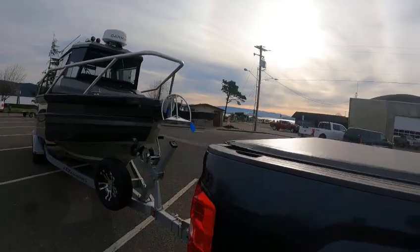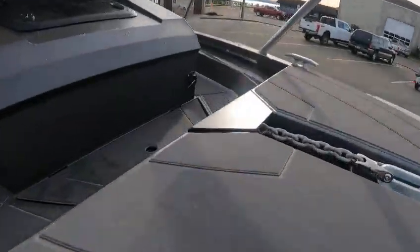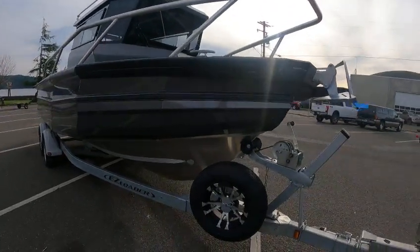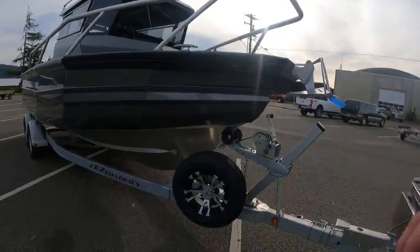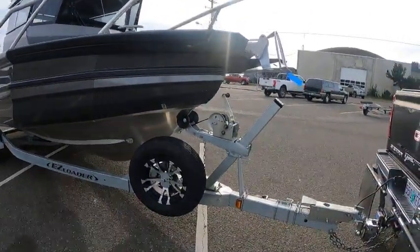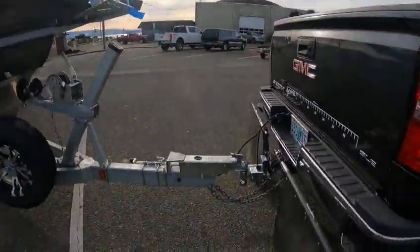Got the delta anchor, got the windlass winch spool — that's the way to go. The spool winches are the better ones because the rope doesn't pull up and get to be a big mess. If it drops in an anchor box there's your anchor drain. With spools it just wraps up, you get more line on there, and they also have spider cable you can run on those.